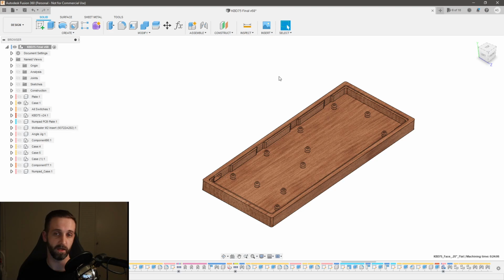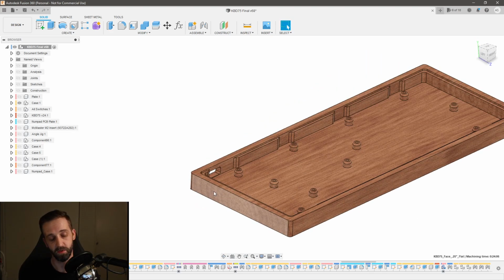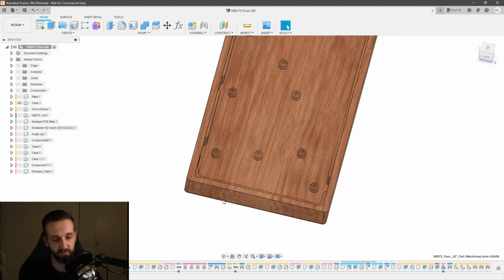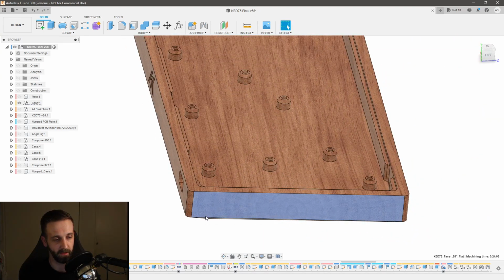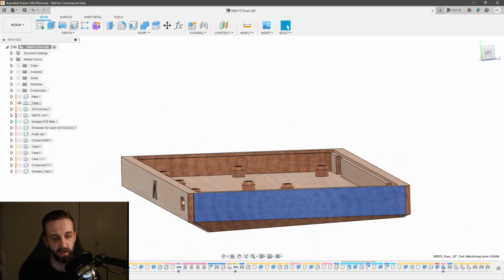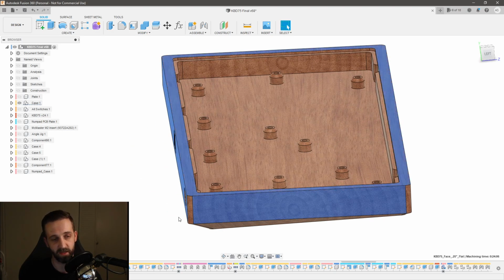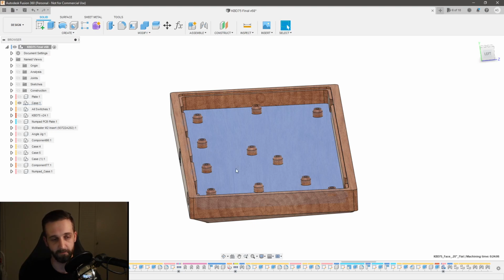And then constraint number 4 is that we need to be able to maintain our work offsets in both orientations. So what can happen, let me see if I can show this. If I'm cutting in this orientation first, and I zero my work offsets to the X and Y, and then to Z, and then I cut down to this pocket, right?